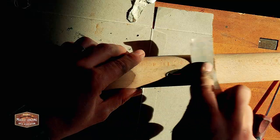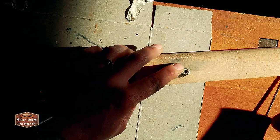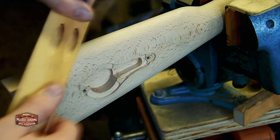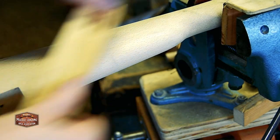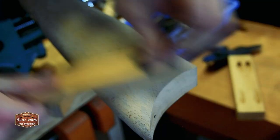After finishing the antiquing on my brass pieces, I wanted to set them back into the stock to make sure I hadn't taken off too much. I checked during filing and sanding — which is something you want to do if you're worried about taking off too much: just fit them back to the stock as you're working to make sure you're not messing yourself up. I ended up having to take off a little wood in a couple places, but it wasn't a big deal. I started with 400-grit sandpaper and found that bumping back to 240-grit was more than enough to remove just a little bit of wood.